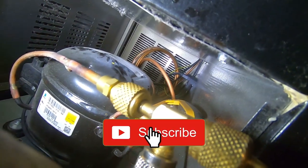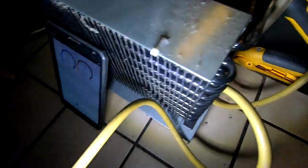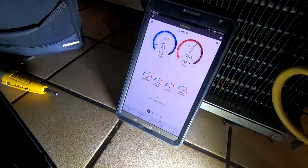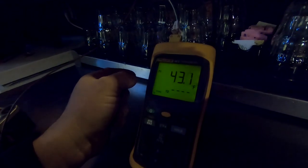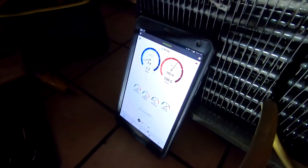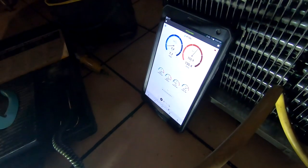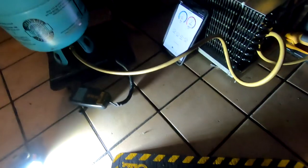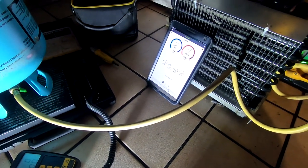The suction line doesn't need to get insulated on this program. I've got my suction probe and my liquid probe there on my dryer. Our suction has dropped a little bit, but our subcooling is only about a degree. Box temperature is at 43 already — she's coming down pretty quick. That liquid line temperature there at 103 — I'd say we probably had just a little bit more to go. It was about completely empty. Nickel and diming it takes longer; the more you do it the better you get at it.